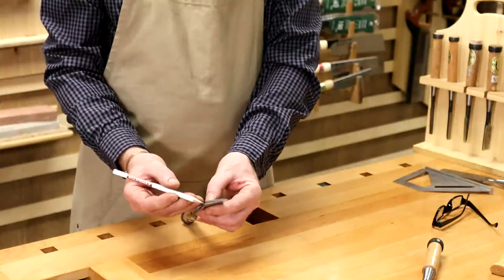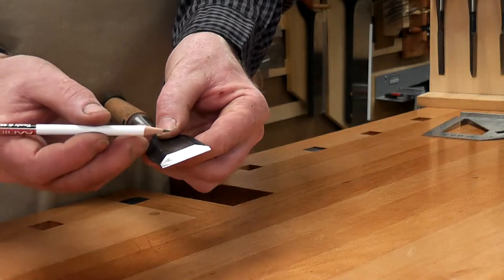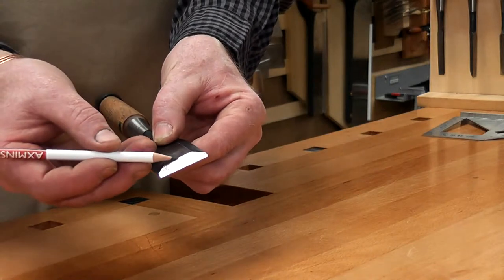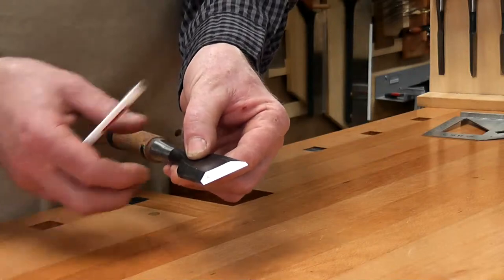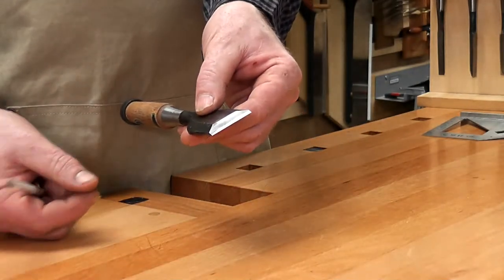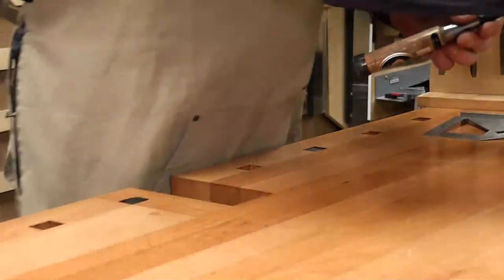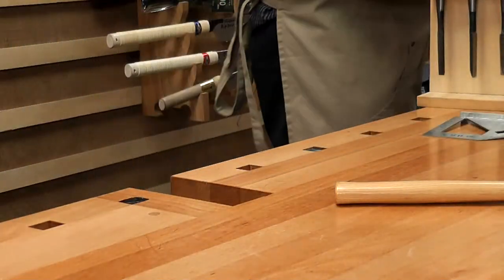But they sharpen everything to one clean angle all the way up through. 30 degrees, 25, depending on what you're working on. 30 would be better for us over here. And they polish it up. So they don't have that secondary bevel. And that will add more strength to the tip, give you more support in behind it, okay? The chisels are designed to be used, if you like, with a hammer, something that you can tap it, clout it with. Quite an important part.